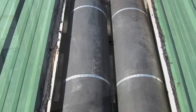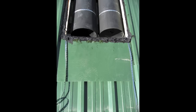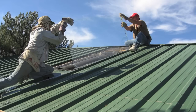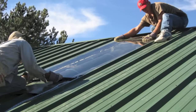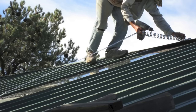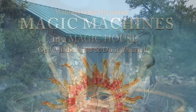Now we're working on the top of the house. You can see that we've already put asphalt around the edges where the glass is going to seal to the roof, and there's already a piece of flashing put in place earlier. This flashing will take the water from the glass onto the roof. The strapping to the left and right overlaying that flashing will be part of the retainment system for the glass. Here's the glass getting ready to go down — a nice bed of asphalt all the way around provides a perfect waterproof seal. We drop the glass onto that seal, lift the strapping up from underneath and over the top, cut it to length, and screw it at the top, which is then covered by another piece of flashing. Here you can see the final product, which looks almost invisible in the roof of a house.